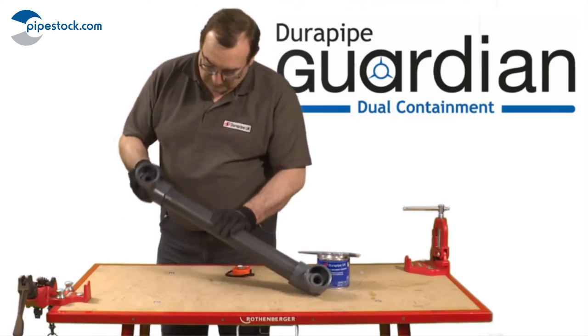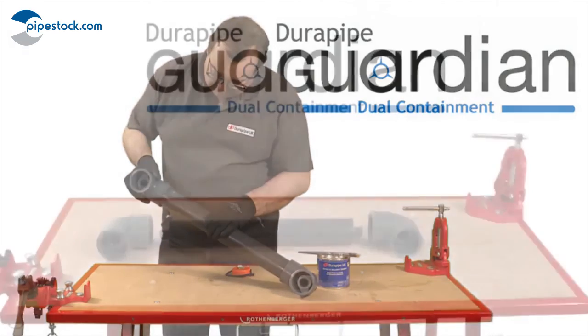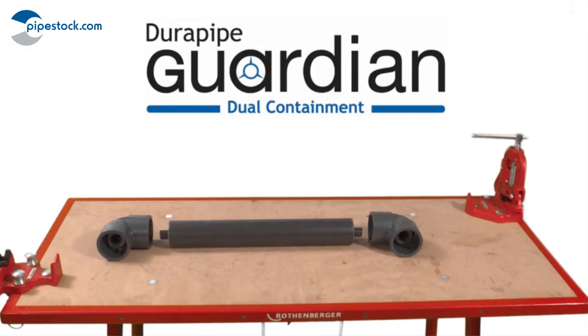Remember, when connecting dual contained fittings to both ends of the same pipe, the calculated difference in inner and outer pipe lengths needs to be doubled, one for each end of the assembly.